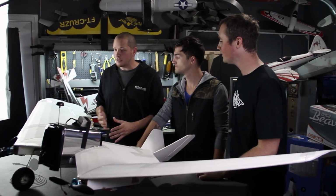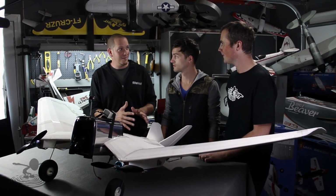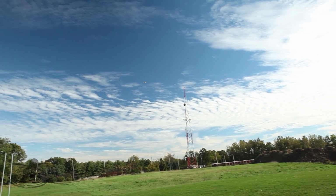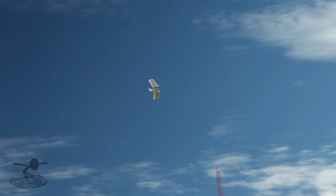So what did you do then? Well, after we realized that the ailerons had no effect whatsoever, we went ahead and did the rear tracking stabilization, and we put a rudder control on it. We took it back up in the air. The ailerons actually cancel out the elevator, but we got enough effect to realize that we had something going. So then we went back, changed this to purely elevator function, and did the V control to purely aileron function. And it was beautiful. It was a whole different animal.